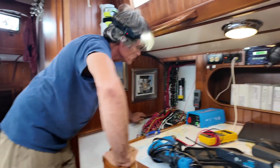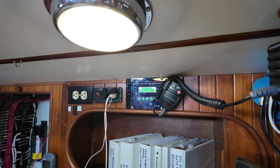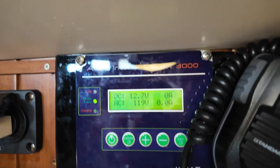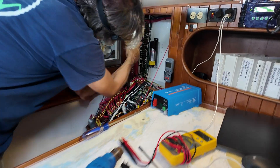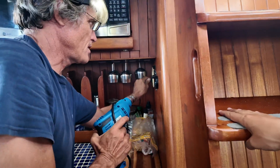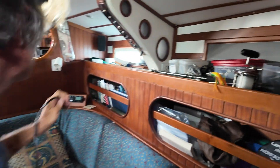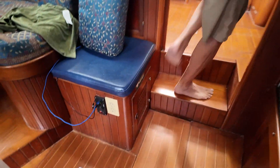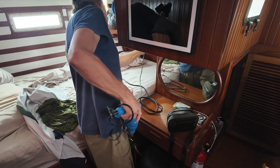Inverter's on - 119 volts out of the inverter, this stuff is hot right now. Don't touch it. Two of the three wires are disconnected. Flipping the breaker on - the microwave did not come on, no power there, dead. We have power on that outlet. Those two are on the same circuit, but this one is definitely separate. And this one is going to be dead too - and dead.